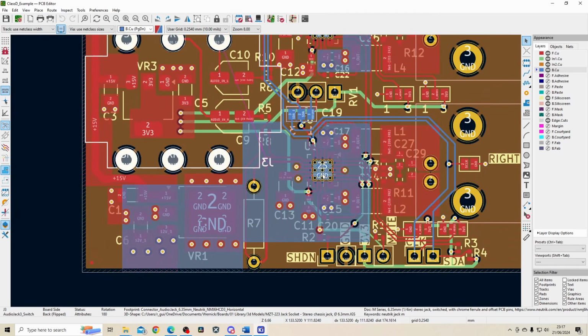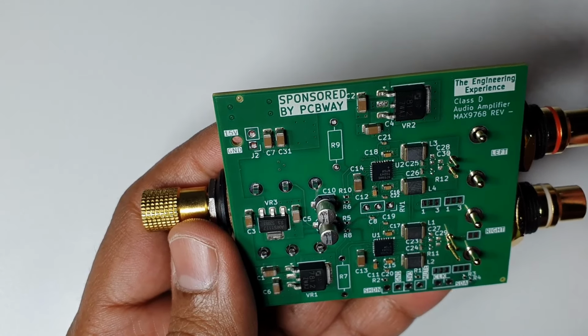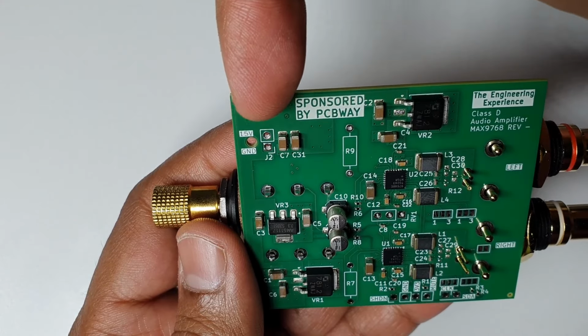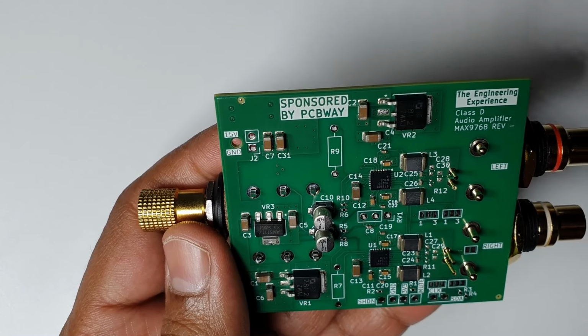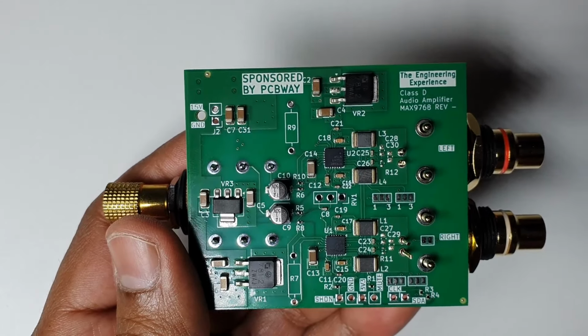We've got the RCA connectors, like I said before. Got the DC barrel jack, which I've ordered and it's still to arrive. And I've got the various input connections that I might use for this board down here. And the two regulators that I pointed out previously. And the two MAX9768 parts. Obviously got the left channel on the top and the right channel on the bottom. I've got my input with the two capacitors. So that's it. I'm going to build it up in the next video and we'll test it out.